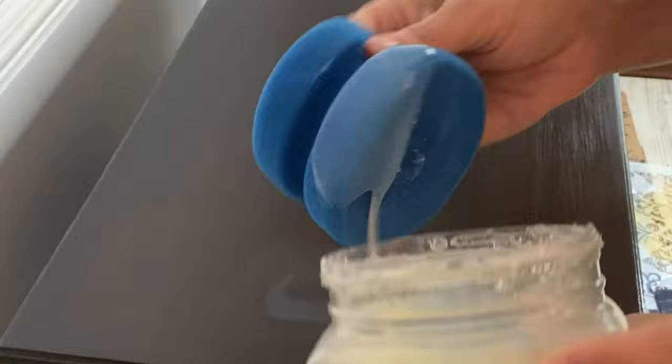You can add as many coats of Gatorhide as you wish. On this piece, I ended up doing 3, very light sand in between the coats to make sure it's nice and smooth. Using Gatorhide over top of that mark will really make it disappear, and you won't be able to see where any of that indentation was located. Try and overlap your strokes a tiny bit when applying your Gatorhide to make sure that you get a nice uniform finish.